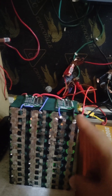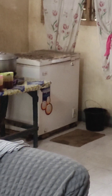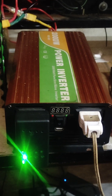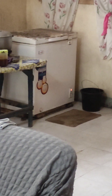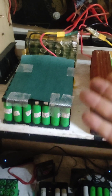I will try to power my freezer to see if the BMS can handle the surge — hopefully it can. The freezer has a 1.3 kilowatt surge. For safety I'm using 20 amp fuses inside, so nothing to worry about. Let's power up the inverter — and yes, perfect! It can hold the surge.